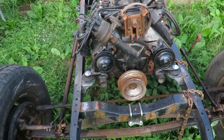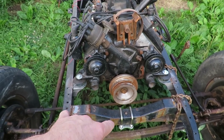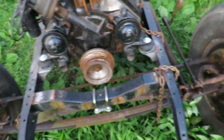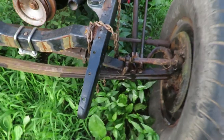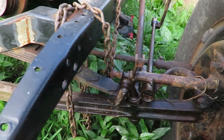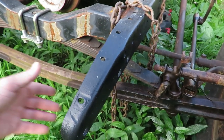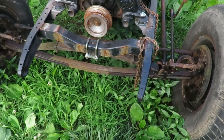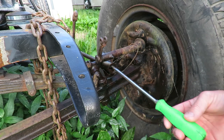I'm trying to save up some money and buy little parts here and there. I had to fabricate the engine mounts, which was a lot cheaper than buying them — got the pucks for like 30 bucks. Next thing I want to do is get the leaf spring shackles, which go right here — you can see these are all worn out and I want to get those replaced on both sides. I'm going to start taking stuff off and getting it painted so whenever I'm ready I can have the frame sitting there, get the front rolled out, get it all painted, and roll it back in.